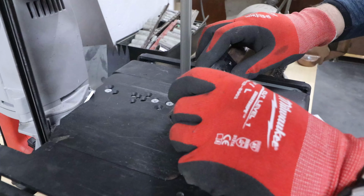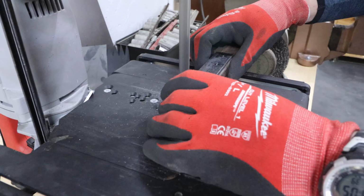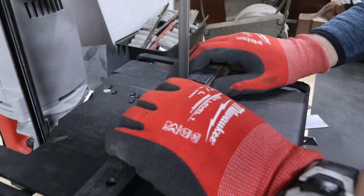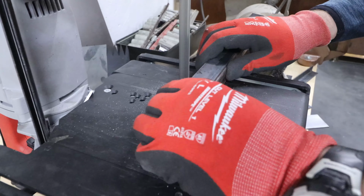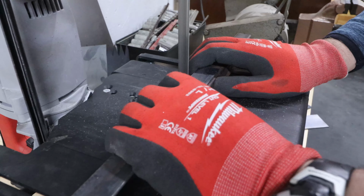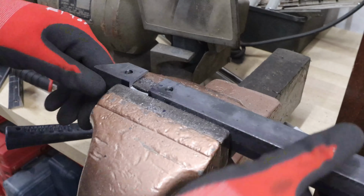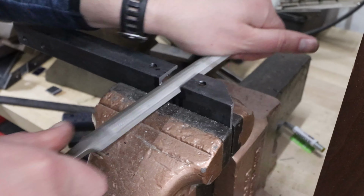These would be a bit tricky to cut accurately the way I have them marked, but using a scrap piece of 1-inch square tube to support the angles makes it easier. I tried to think of a good, accurate way to cut the ends of these, but finally just opted to use a vice grips and snap them off instead. If I had a milling machine, it'd be a different story, but I don't.